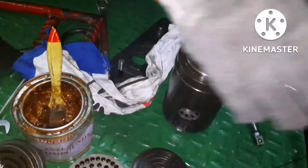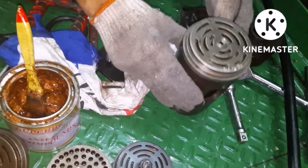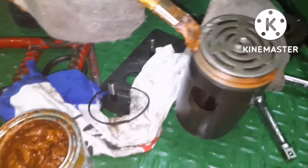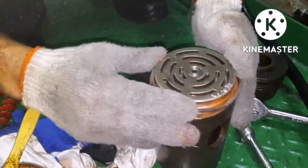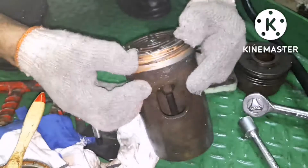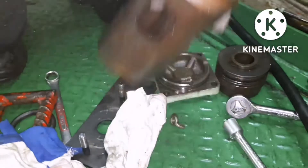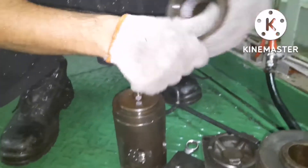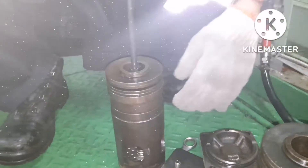Put the copper gasket back. Sometimes the copper gasket will fall down, so to avoid this, give it a coat of anti-seize so that the copper gasket does not fall when you are inserting it in place. The copper gasket is now in place. Next, we have to fit the valve inside the area — fix all the parts in place and use the tool to screw it in.